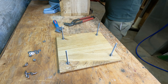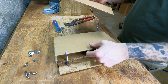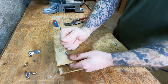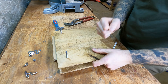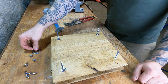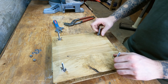Once all the pieces were finished and ready to assemble, I started cutting out eight cardboard sheets to go in between the top and bottom panels. To assemble, you just drop all of the carriage bolts into their respective slots in the bottom panel, then flip the board over. I'm using a quarter-inch washer with a lock washer on top of that, and then a nylock nut on top of that, just to prevent the carriage bolts from getting loosened up over time.